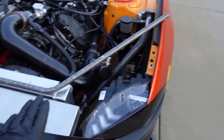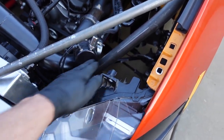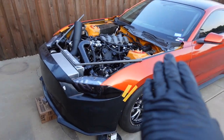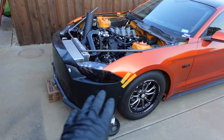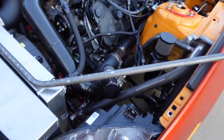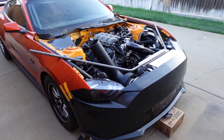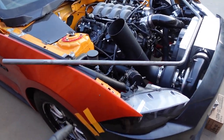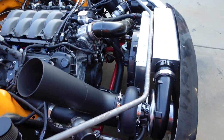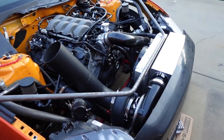The angle — I originally thought this bar was going to be flat, straight across and connect to this bar. But Ryan, the guy helping me, thought it was going to angle down. Thinking about it more, with the slope of the front end and how the other bars are coming down, I think it'll look better if we tie it in higher and slope down to match the body lines better. So we're going to start trimming these down, use a grinder to get the fitment good on each side, then tack it up.